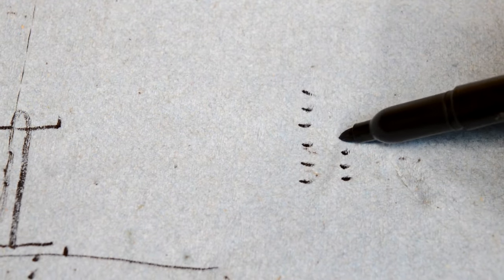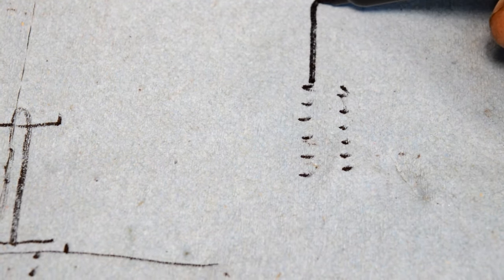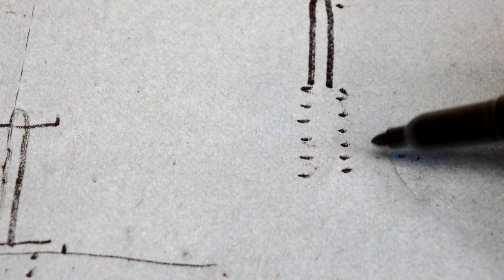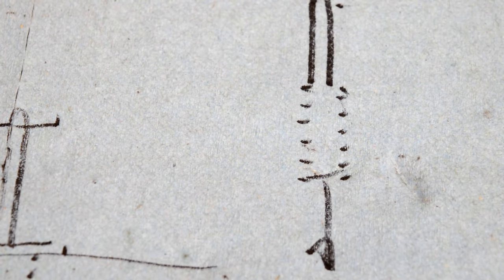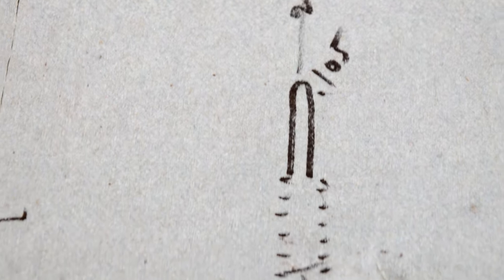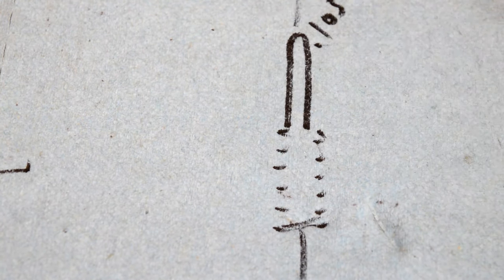I'm taking an 840 existing screw stud and then turning it down until this part here is 0.105 in diameter. And then I'm leaving this end of it stick out that side, and I'm leaving this end of it stick out that side until I can fit it in there and make it all fit. So we're going to make a change here in the engineering, and we're actually going to make a piece that looks like this.